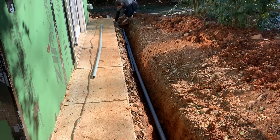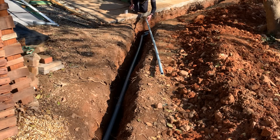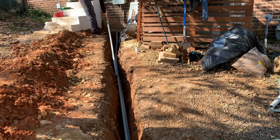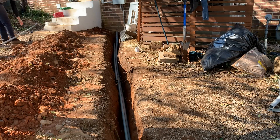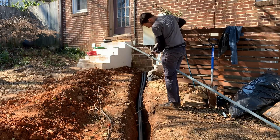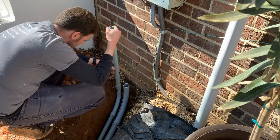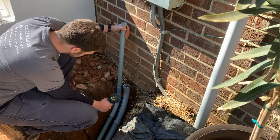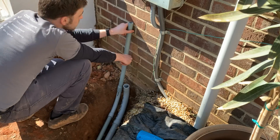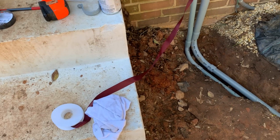For the data line, I'm going to be using a 1 inch PVC pipe right alongside our power conduit. I'm going to be leaving this one empty for now and eventually pulling fiber once I'm a little closer to finishing out the interior of the workshop. I'm using fiber to isolate the line from any electrical interference, since both conduit runs are going to be right on top of each other and running parallel for almost 50 feet. You would never want to run ethernet or any other type of low voltage data line in this sort of setup unless you're going to be adding some shielding or creating more distance between the two pipes. Here I'm adjusting the position slightly for this PVC pipe, using a heat gun to help make the PVC more pliable and then holding it in the final position I want while it cools.